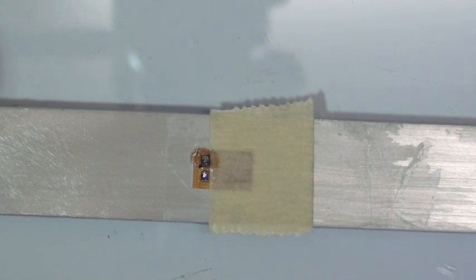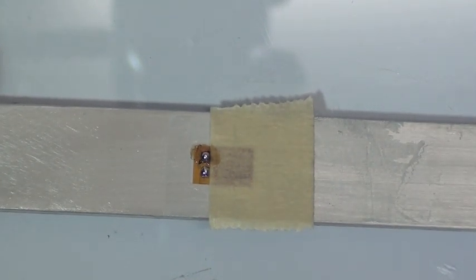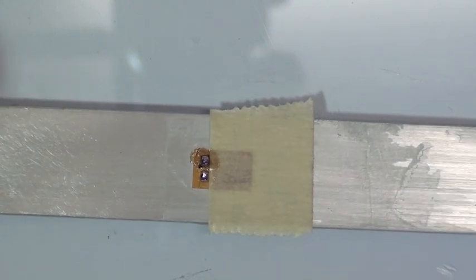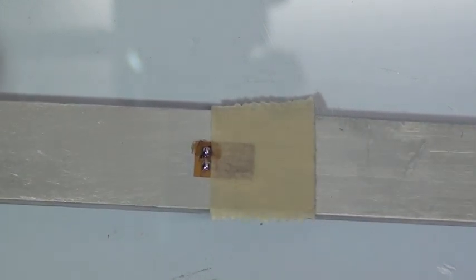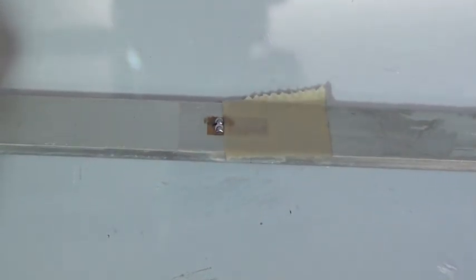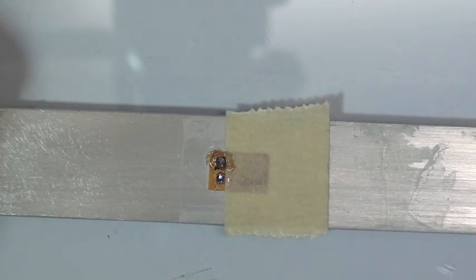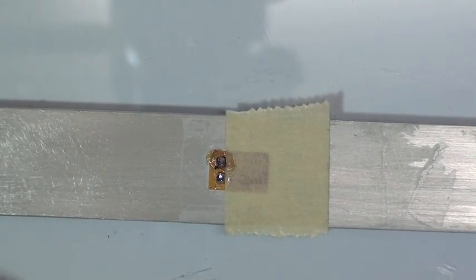So if you want to prevent the Hershey's Kiss appearance of the solder connections, with a little sharp point on it, the trick is to pull the soldering pencil and the solder away at the same instant, just as VJ illustrated. That's what's going to give you that nice rounded connection. If you pull the solder away first and then keep tapping it with the soldering pencil without the flux present, the surface tension is going to reappear and it's going to drag the solder with it.